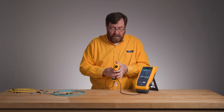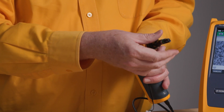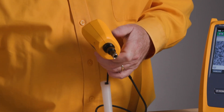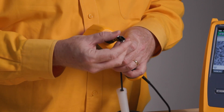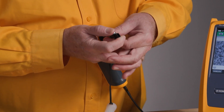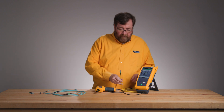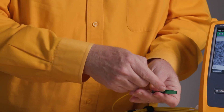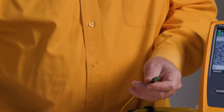While we're talking about new tips — as I hold the camera facing away from me, it's lefty-loosey. We can take this tip off because I want to show you a new connector you may not have seen before. For this new connector I'm going to use this new tip — different tips for different connectors. Facing away from me, it's righty-tighty to put this on. This new connector type is something the big fancy data centers are using — it comes from US Conec and it's called an MMC connector.